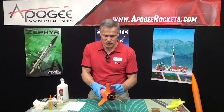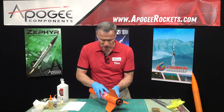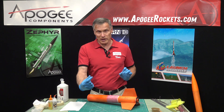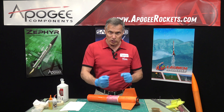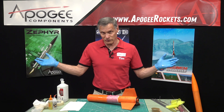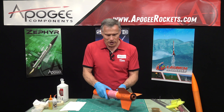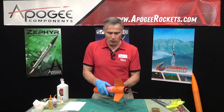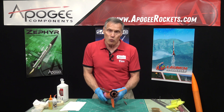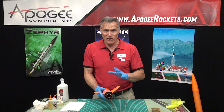If you really want to cinch this down, one of the tricks that I've used before — I won't do it here because this one's not that important to me — but you can take a long strip of plastic and wrap it around and pull it tight. I've used old VHS videotape — you're never watching that stuff anymore — so you can take that and just spiral wind it around this area and you can really cinch it down. What that does is it evens out the epoxy and really pushes the fiberglass down against the tube. Because as I said, it's the fiberglass that gives it the strength.